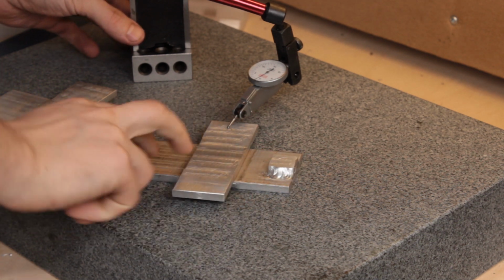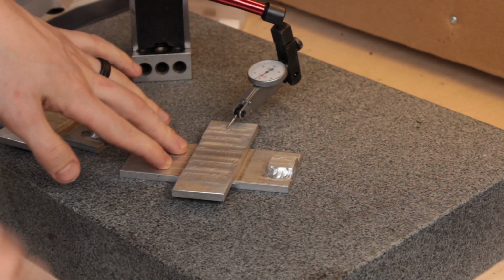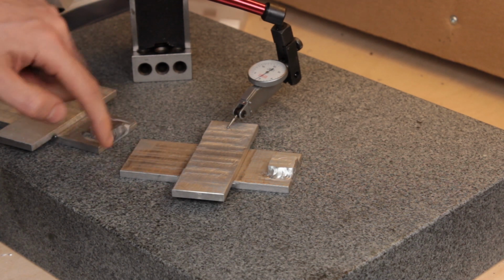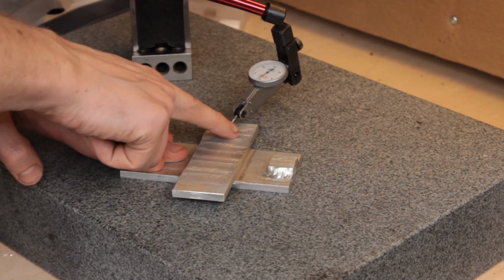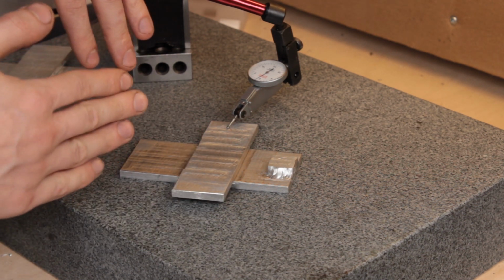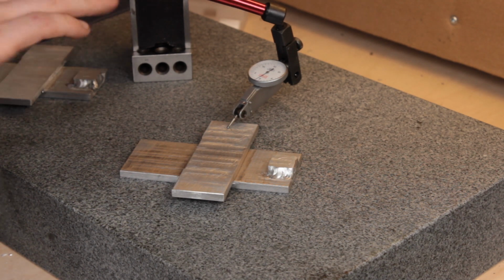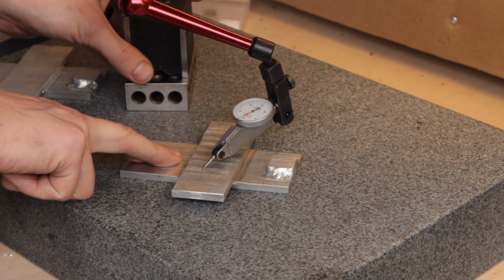So I've got the side plates welded up, and I'm trying to check how flat and square they are, so that when the side beams, like the gantry pillars, get mounted in right here, running up this way, these two plates where the wheels are going to run are coplanar with it, and therefore the axis of the wheels is going to be exactly perpendicular and parallel with the actual frame itself. Now this one actually looks pretty good.